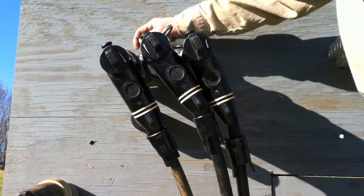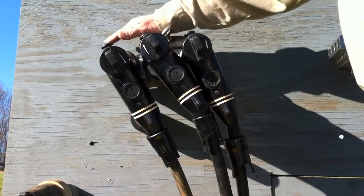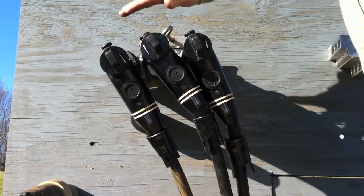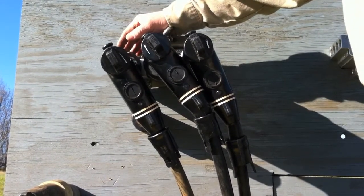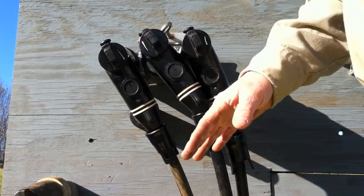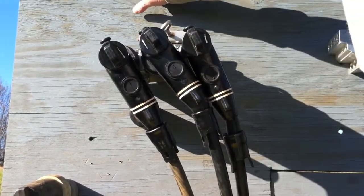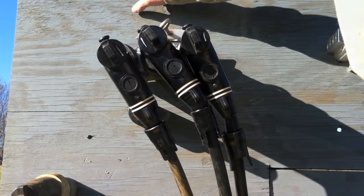Plus, as far as the research I've been doing, if you lose that first transformer off your loop, when you're back feeding out to the main line, then your wind farms are down. This way, if you had a fused elbow here on your 3-phase pad mount and you lost this transformer because of the wind coming up and down and throwing your transformers off, it would isolate this transformer and still keep your other transformers and wind turbines working and producing.